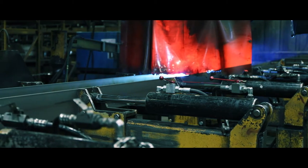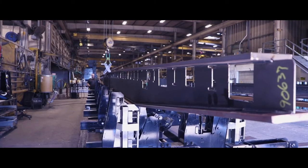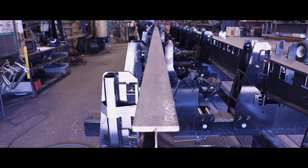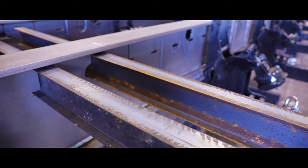Once the main beams have been produced, the inner beams are loaded into a Landall precision welding fixture that will clamp the beams to ensure straightness to within an eighth of an inch, and will also consistently locate the roller pockets for proper undercarriage travel after final assembly.